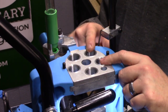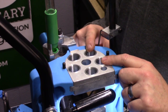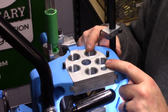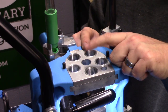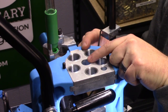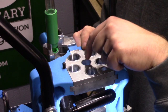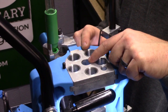If you are running a bullet feeder and must have the powder cop, you're going to run your bullet feeder there and then run a combo seat and crimp die in station five — which I don't recommend. A lot of guys wonder what the hole in the center of the tool head is for — it's not just for a light. If you're running rifle and get a stuck case, you can access the main shaft bolt through this hole in the tool head.